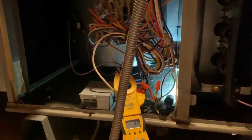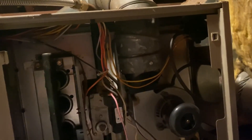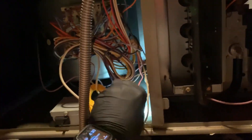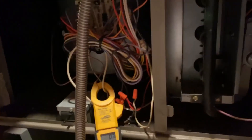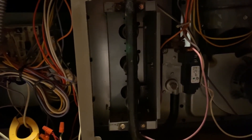We're going to close this up and cycle it from the thermostat to make sure everything's good. We're calling this a sticky pressure switch. We are going to recommend replacing it as a proactive change, but I'm not going to require it. This is a temporary fix because it'll probably get gunked up again. No heat is now heat — thanks for watching.